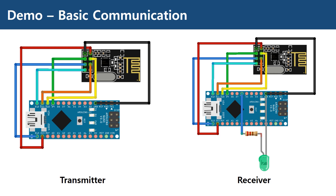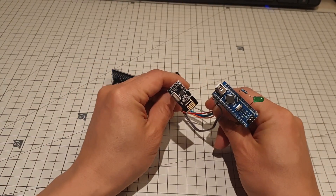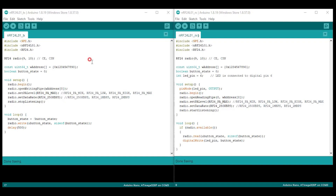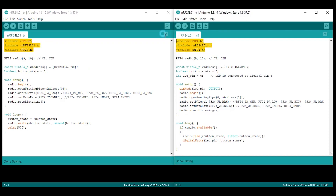Let me show you the demo for basic communication of two NRF24L01 Plus modules. Both transmitter and receiver are using Arduino Nano as a host processor. The transmitter periodically sends a boolean data to the receiver, and the LED connected to the receiver blinks according to the signal transmitted from the transmitter. These are the modules used for the demo. This one is the NRF24L01 module with a PCB antenna used for the transmitter. These are the codes used. You need to install the RF24 library, then include the headers and create an RF24 object with two arguments indicating the pin numbers for CE and CSN pins respectively.